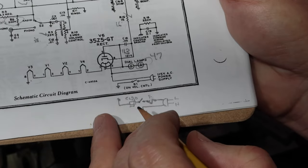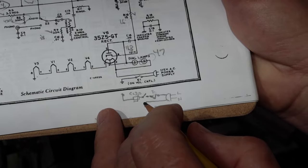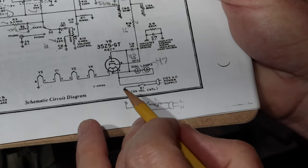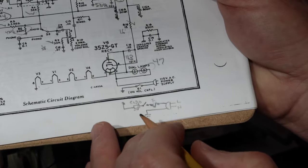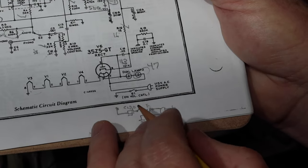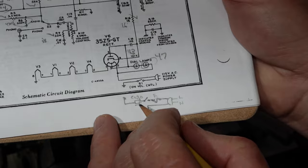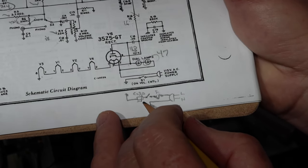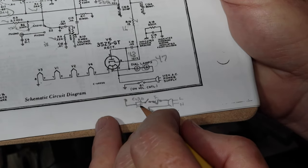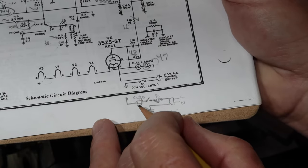And I've done this experiment on some other radios. I think it was the Starlight, where I've demonstrated that a CL90 seems to work pretty well with sets that have this kind of energy consumption to drop the voltage down into this range of voltage, which is what I want. So that's why I'm using it. Granted, if you were to use a thermistor purely as inrush limiting, it might not be appropriate, but I want it to have that residual resistance anyway. So that's why I'm just going to go ahead and stick with it. Plus, I have a bunch of them, so that's what I use.